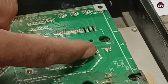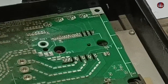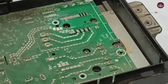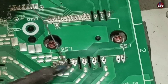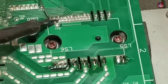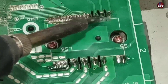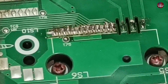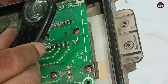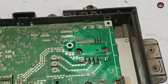Now the IPM has been touched with the heat sink. I will tighten the screws of the remaining components too. All the components will be appropriately aligned with the heat sink because there should be no gap between them and the heat sink — the components will heat up if any gap is present. Now I will solder the IPM. All the pins have been soldered. I am moving the soldering iron over the pins to clean up the solder. Check whether any pin is joined with another, because if any pin is bridged, the motherboard will fail immediately. I use a magnifier to check this — all the pins are fine and no pin is joined with another. The IPM has been soldered on the motherboard.